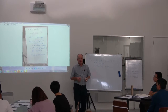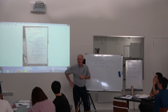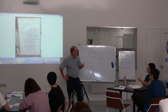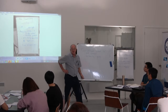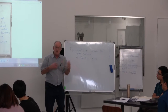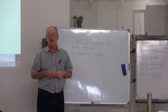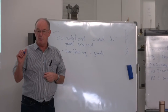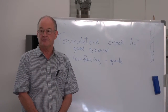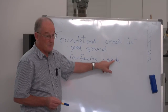I walked on site and I said to Coxey, where did you get the steel from? He said, oh, I've got it from Placemakers. And I said, well, you've got the wrong steel. Your plans clearly show high tensile steel, and you've put mild steel in. Tell me why I should sign that off in front of your camera here, because they had the TV camera there. Why should I sign that off when you've purposely cheated and put the wrong steel in? Well, at that point, the camera's turned off. So, reinforcing, the grade's most important.